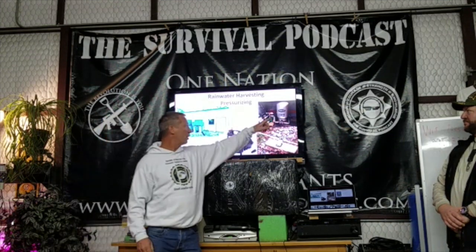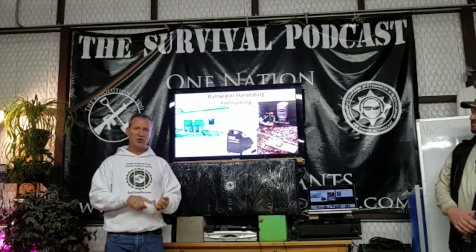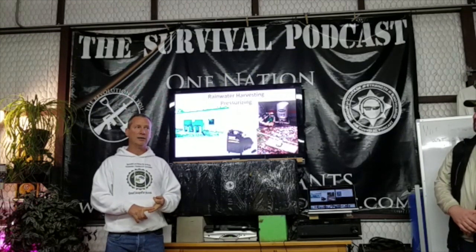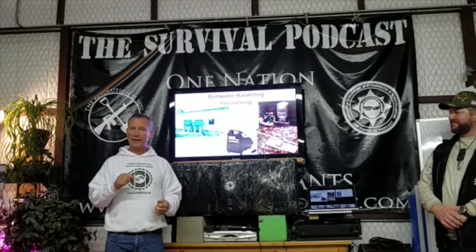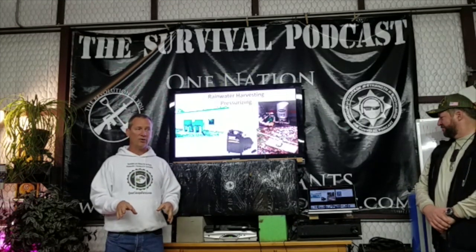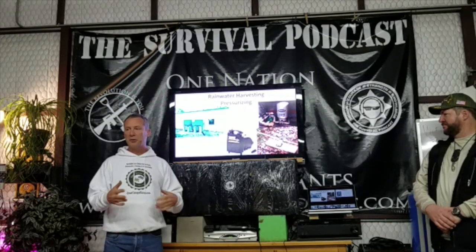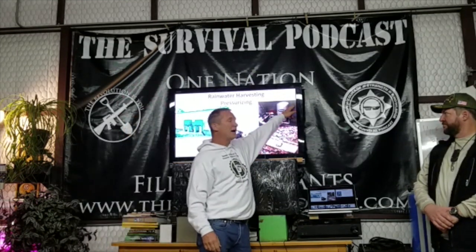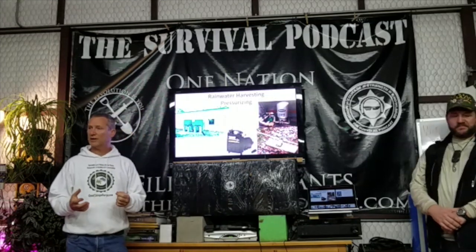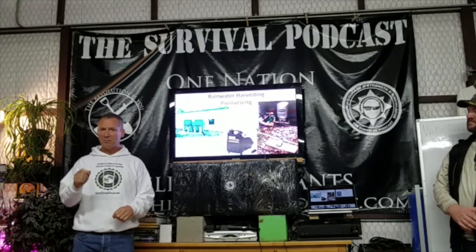And then my $1,200 option up here, which costs more than everything else together, but I run a nursery business. I need high pressure all the time. Even if power goes out, I need it at least to go a couple hours because I'm running a mist irrigation system, and I cannot afford for water to be out for more than about 5 or 10 minutes. That pressure tank will keep me up for a good hour or so if I lose power in the middle of summer, as well as, you can't see it, but I have additional filters over here because with the mist irrigation system, I can't have any debris, any junk whatsoever in there at all, even microscopic stuff.